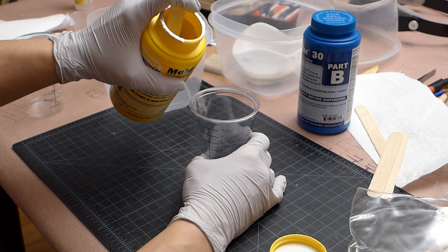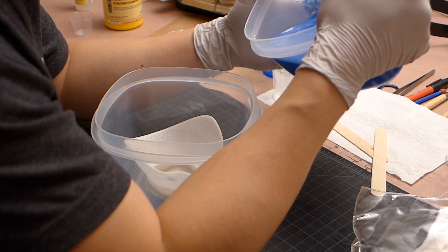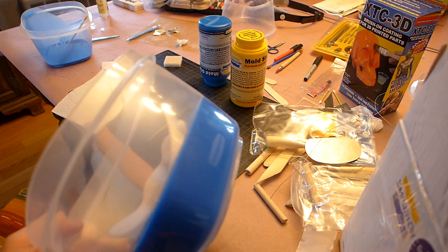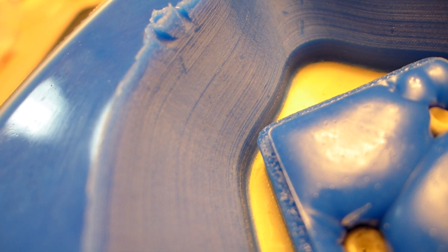The way I approached this problem is to tweak the tech stack — something we do in architecture all the time — to make sure the approach will meet the requirements. So I updated the design, sanded it all the way down, and created a mold using platinum-cured silicone. Then I tested a few different resins in the mold. The result is a perfect replica of the original, including all of the sanding work and the flange.